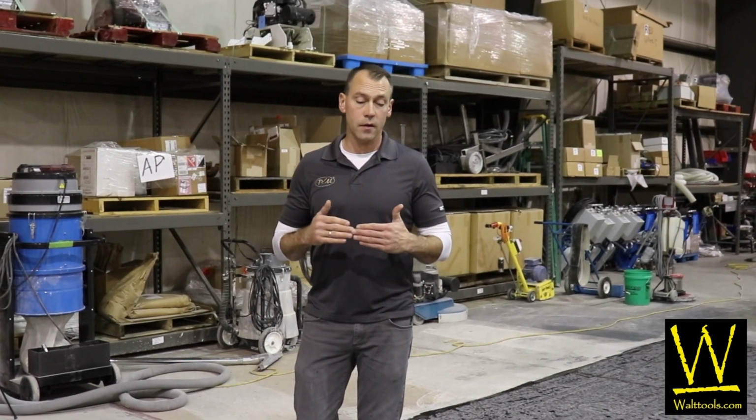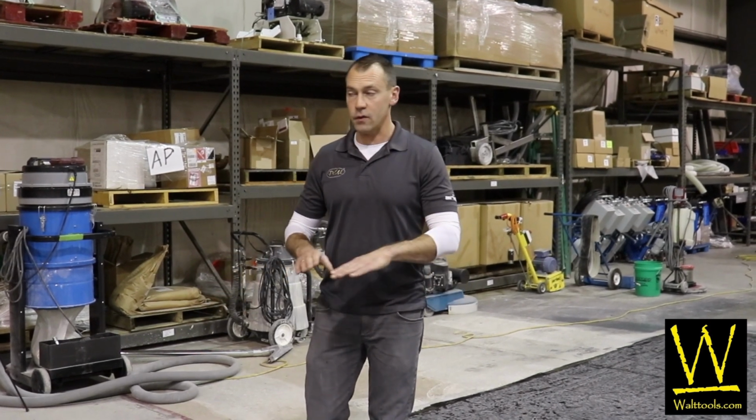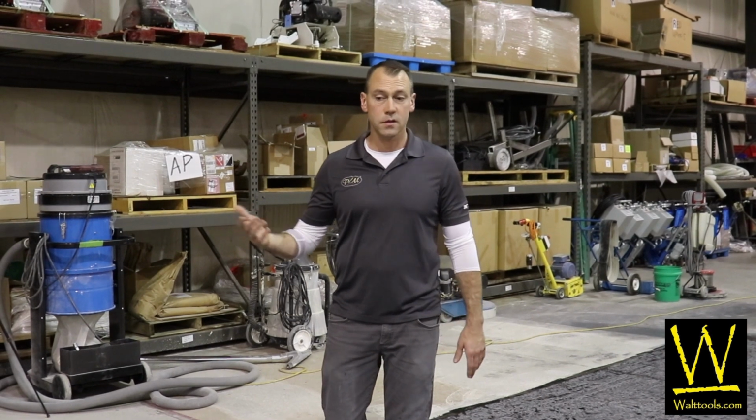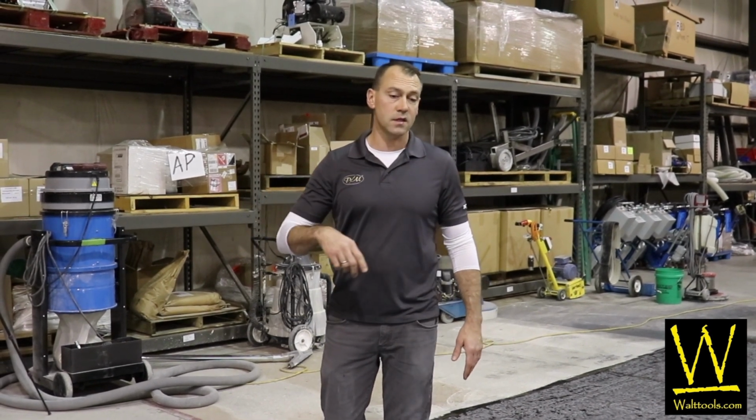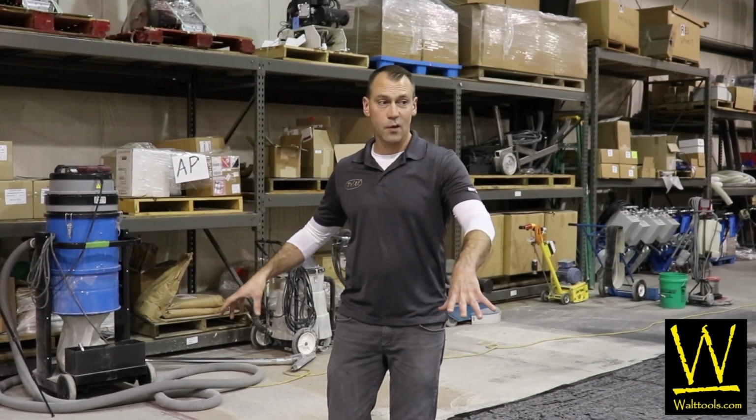The mistakes I've made though has been not having a monotone background, because we're going on with only 7 mils of material. We already measured this out. We know we're doing 45 total mils. We're going to lose a couple ounces in the roller. We need to put on about 39 total ounces over this whole area. That's how precise it has to be.